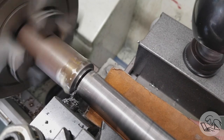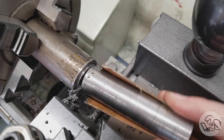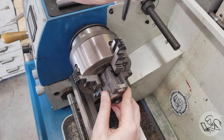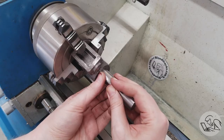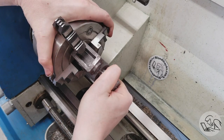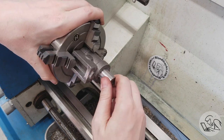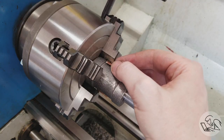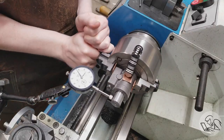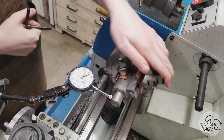I'm parting off a little bit far from the chuck here, so I have the tail support in there for most of this operation, and then as I get close to the end I pull it out. I ran out of room — couldn't quite get in there with the parting blade all the way, so manual yahtzee. Now I can set up the casting. I'm clamping it relatively loosely in the four-jaw chuck, then I insert the mandrel. I've got a shim on there to take up the extra space because I turned it a little bit undersized.